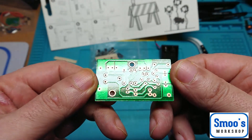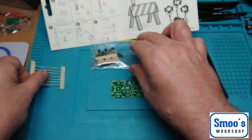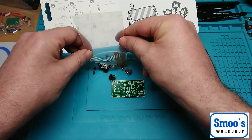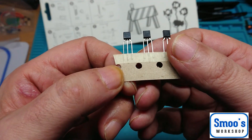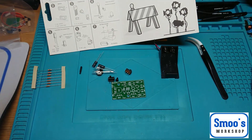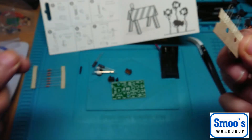There's a very small component count, so the review will be pretty short. We've got two BC547Bs — 547s. Let me just check what a 547 is; a BC547B is an NPN transistor, as opposed to a PNP. So it's a standard NPN, positive-switched transistor. All three of them are the same, so we've got three BC547B transistors.